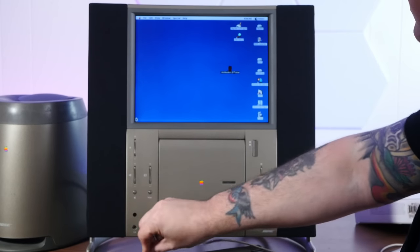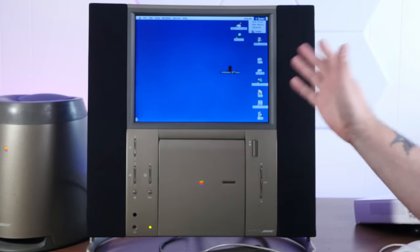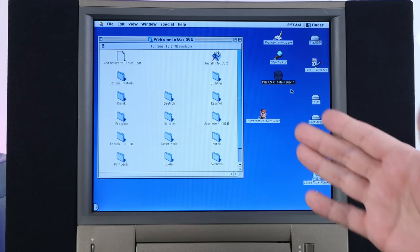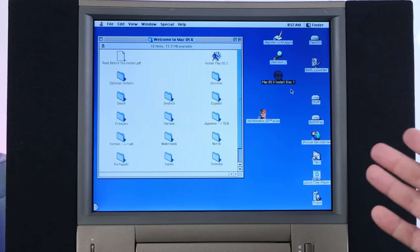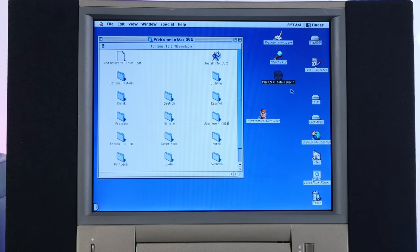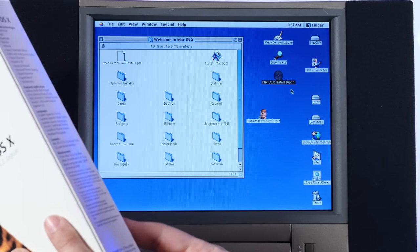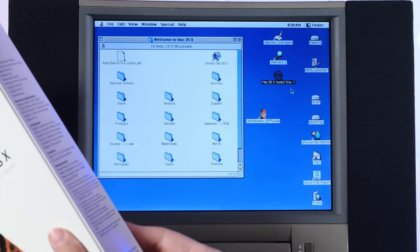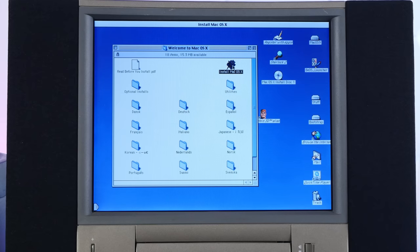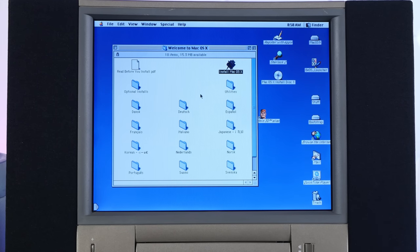Anyway, let's just see if we can get Mac OS 10's installer to boot on this thing and just make sure the installer can see that we're on a G3. So to boot 10.2 Jaguar, we technically don't even need any hacks like ex post facto, and in fact, 10.2 Jaguar should work on a 603e processor, although actually the box for this says that it requires a G3 or G4 with 128 megs of RAM. So anyway, let's see if it'll run on our newly created G3. No. All right, we will need ex post facto.